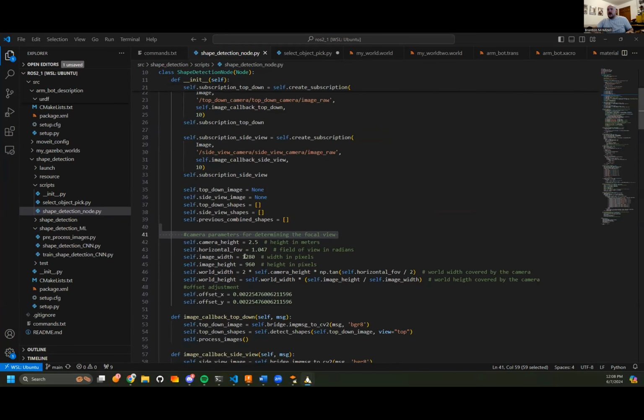So we can verify the relative accuracy of this. This blue sphere, I just moved it. I'm going to come here to pose, click on the sphere, pose, and we're going to see that's x 0.56 and y minus 0.07518. There is a little bit of error that we're trying to mitigate, but you can see that it's 0.61 and minus 0.0135. So it's assigning these to a relatively high degree of accuracy based off of just a pixel input.